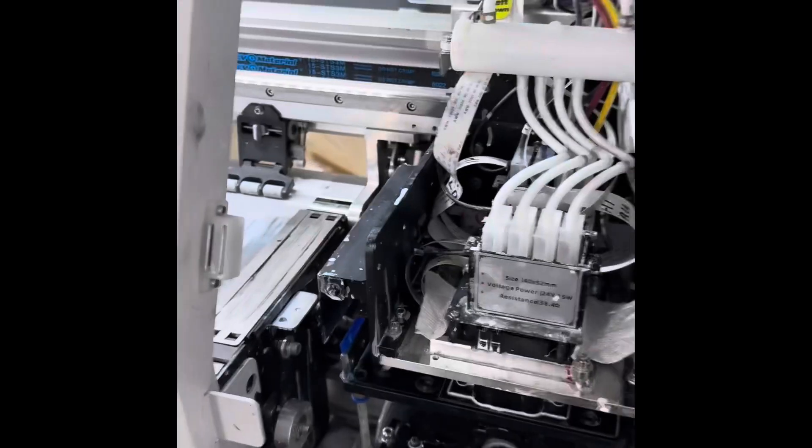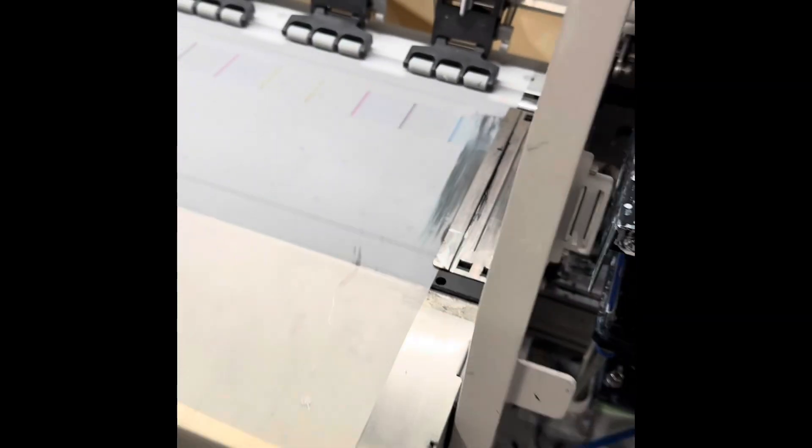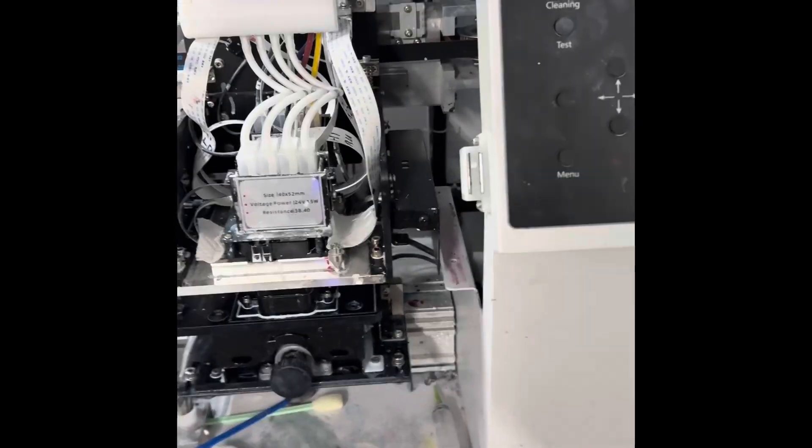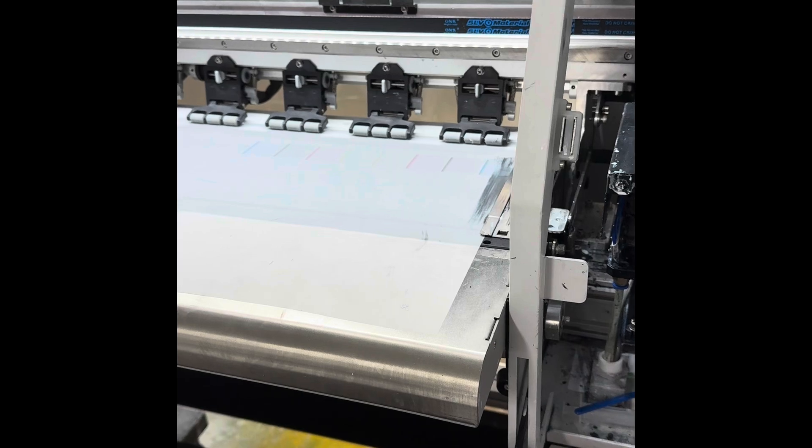Let this go through the cleaning cycle. I can give you guys a good look at these nozzles — or what they don't look like. See that? There's like 50% missing. Really bad nozzle checks. It's essentially not even there. And of course CMYK is perfect. I hope this does it — it's not fun.